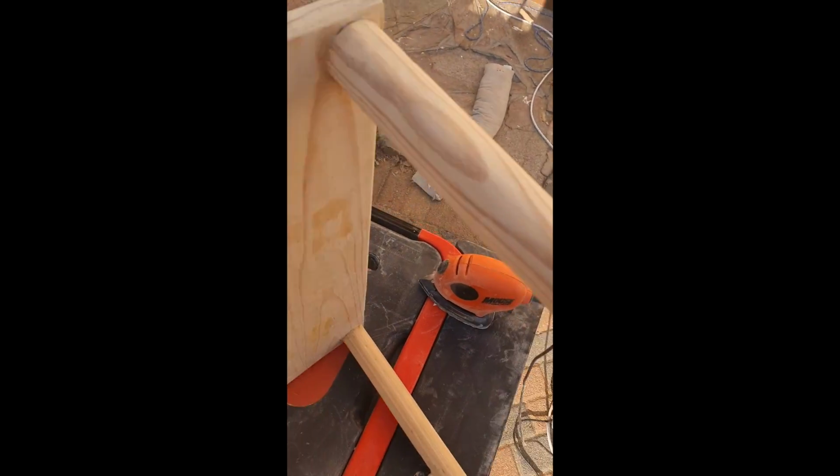So as I say, whenever you get wood that you're going to repurpose, you're going to find blemishes and cracks and things. Now this crack here goes all the way through the side and on the top there. Now this table's not going to be used for anything heavy. Okay, I'm actually leaning on it now. It's very, very strong. The table's not going to be used for anything heavy, so the easiest thing to do is to fill that crack and let the filling dry and then sand it down.